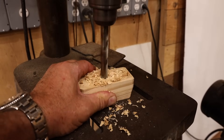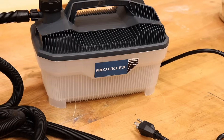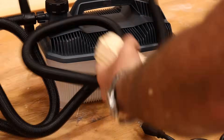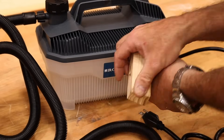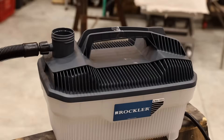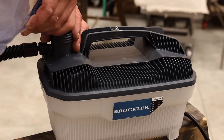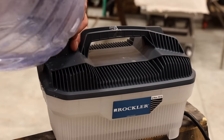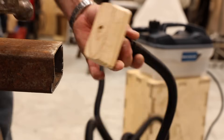I just make these wooden plugs. The Rockler steam bucket comes with this brass fitting on the end here, and I just roughly fit it in there — that was a half-inch drill and it fit in there perfectly. This bucket will only work if you're filled up to a certain height, so if it steams off and you're not around, it's not going to melt or fall apart — it'll just shut off.